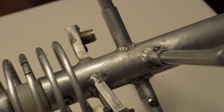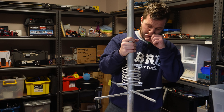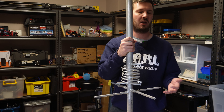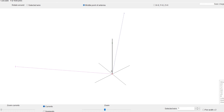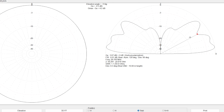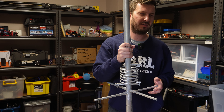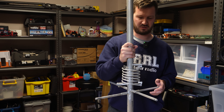This is quite a beefy antenna that can handle quite a lot of power - I think a couple of kilowatts at least, not that I'm going to be running that much. A 5/8th vertical offers just that little bit of extra gain and also a lower angle of radiation compared to the Station Master. If you model 5/8th, half-wave, and quarter-wave antennas, you'll notice the main lobe for maximum gain is a lot lower for 5/8th antennas. Because 5/8th wave is about 0.64 of a wavelength, this one ends up being about six and a half metres long, so you've got a little bit of extra capture area too.